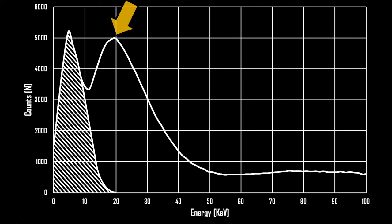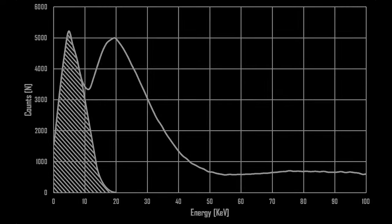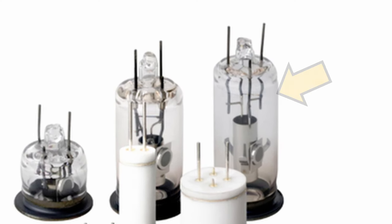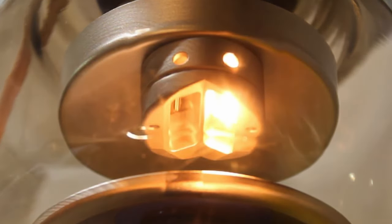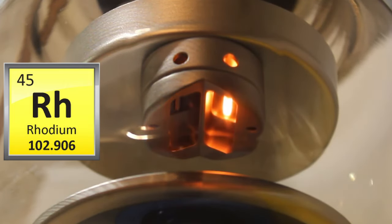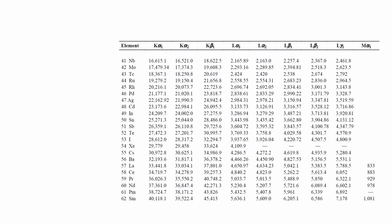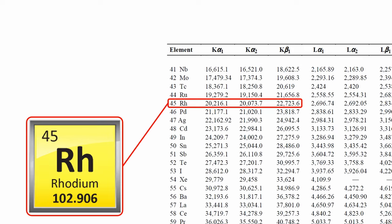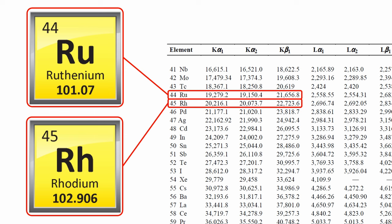But there is a clear peak at about 20 kV. My current working theory is that this is x-ray fluorescence from the K-shell electrons of the target material. The tube is made by the equipment manufacturer itself, so they don't supply any datasheets. All x-ray tubes need to take measures to protect the anode from being damaged by the electron beam, even when used with a very low duty cycle. Often, a rhodium coating is added to the tungsten anode to improve its lifetime. Looking at a table of x-ray fluorescence spectra, rhodium has three K-shell emission lines just where we are seeing our mystery peak. That said, ruthenium is also a candidate material, as it is also used to protect the anodes of x-ray tubes.